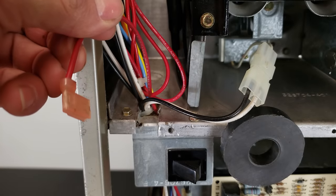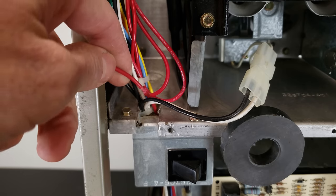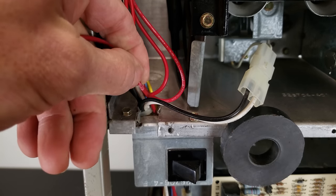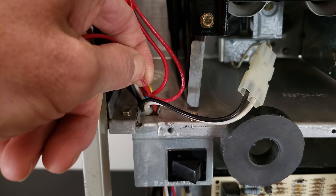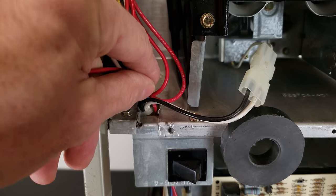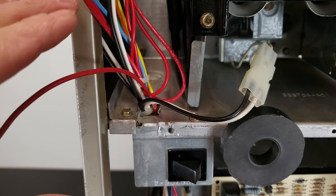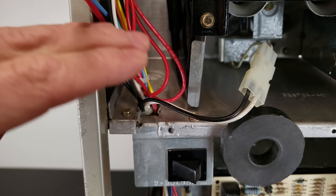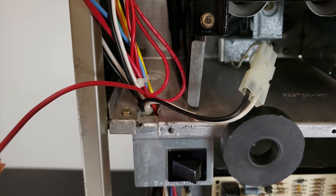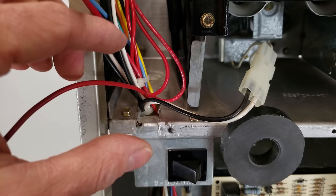Here's where the problem wire is — right here is where it was rubbing up against the ground frame. You can see inside there where the wire was rubbing against the ground frame. The method is: split sections of wire apart from each other to determine where the problem is, keeping splitting in half and testing that half, then splitting again — basically isolating where the problem is located.